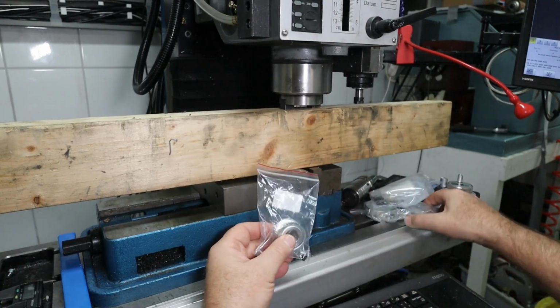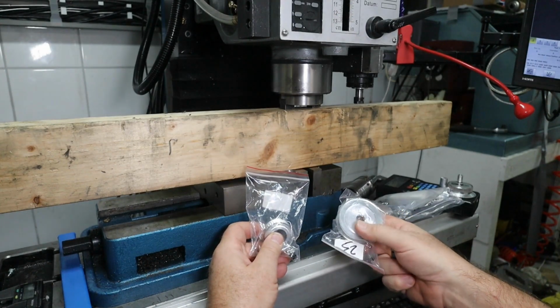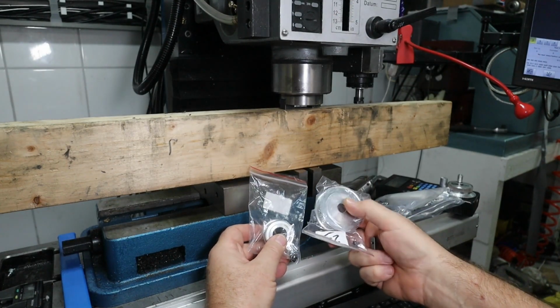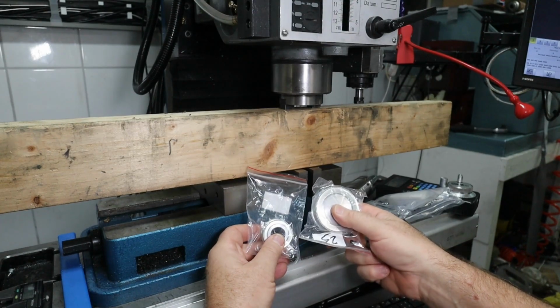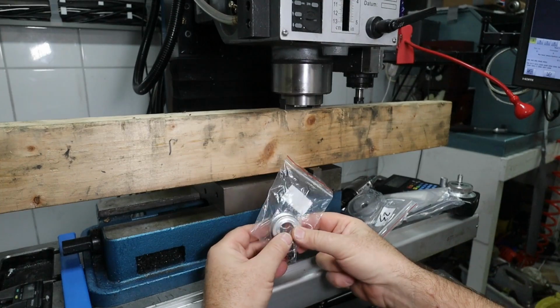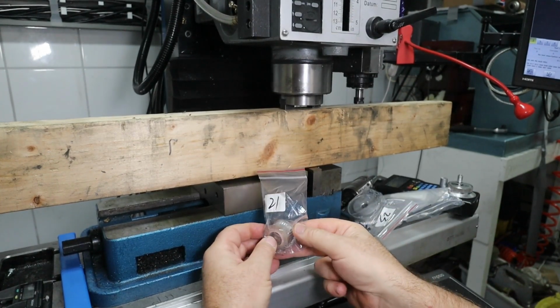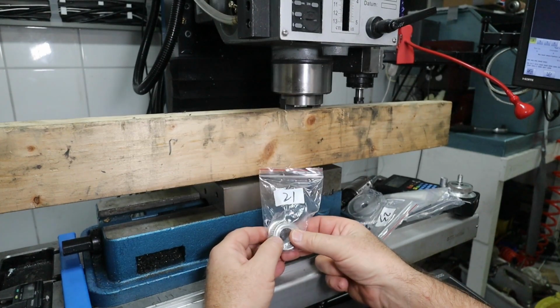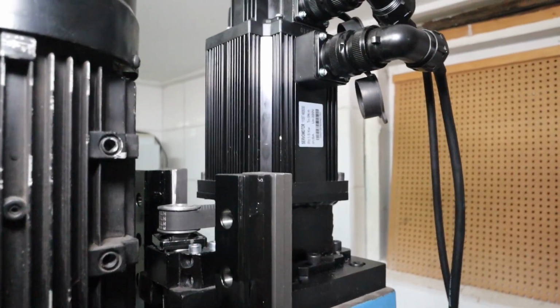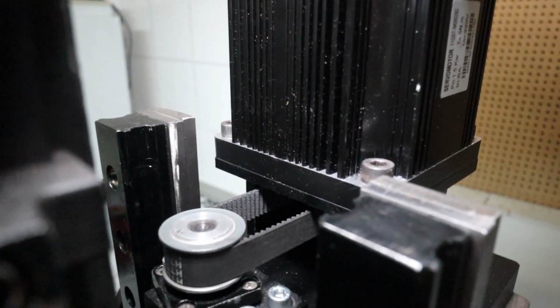So I have got some pulleys here. I will change the gear ratio. Is it called gear ratio when belts are involved? Anyways, I will switch to a much larger pulley on the ball screw and keep the smallest one I can have on the servo motor. This is 32 teeth, and one of those sits up there right now on the servo motor. The problem is that it sits with those set screws, and it is so weak.